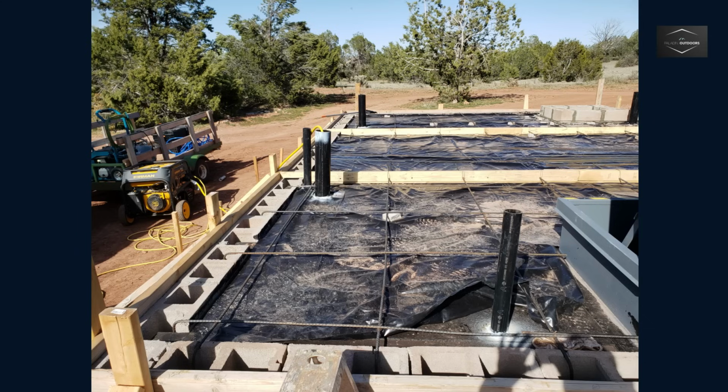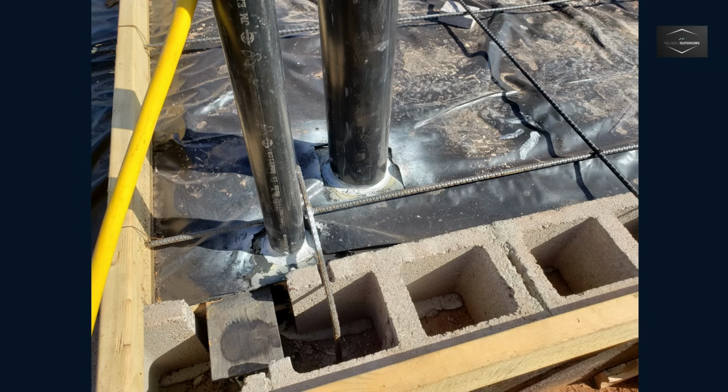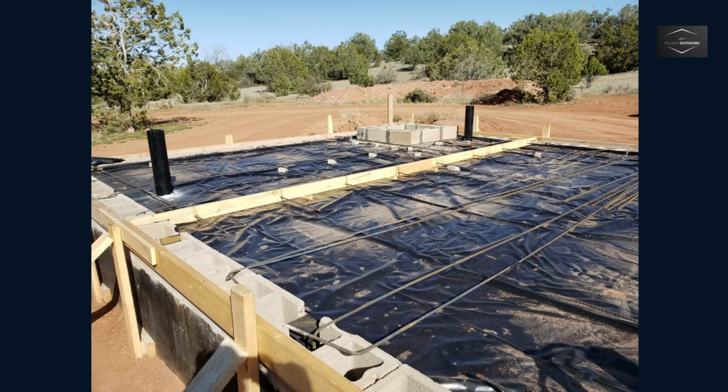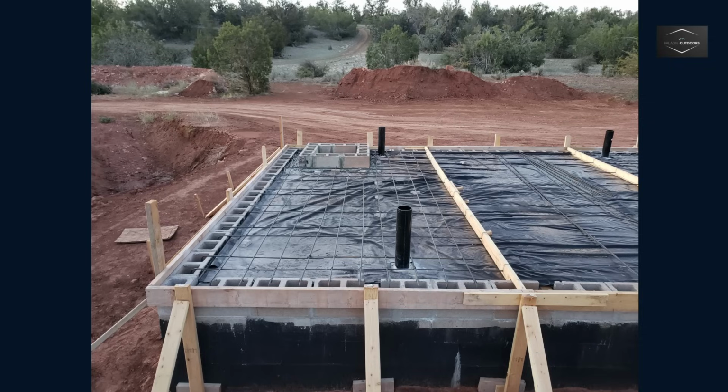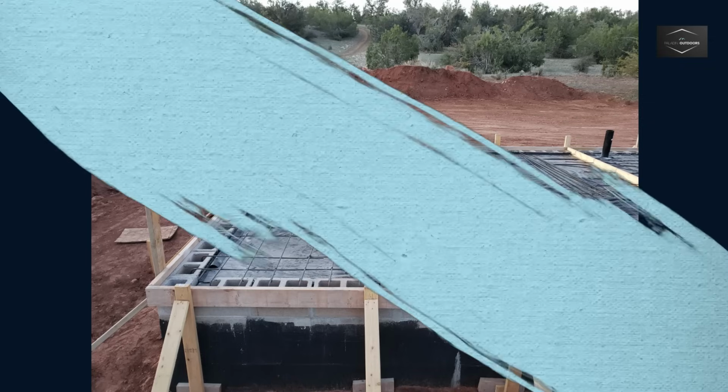2-inch ABS pipes were inserted into the holes cut for utilities. However, it did not fit and had to be enlarged with the plasma cutter. After the 2-inch and 4-inch pipes were secured, the gaps were sealed with silicone. Rebar was bent at 90-degree angles to anchor into the block wall vertically. The rebar initially formed 24-inch squares, but I upgraded to 8-inch squares to ensure stability.